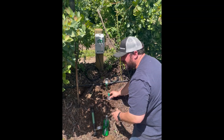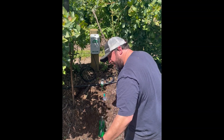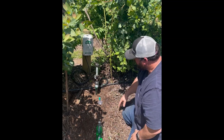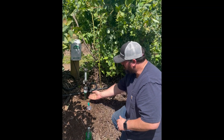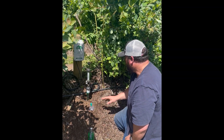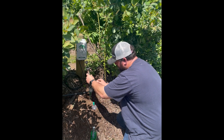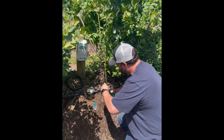The last thing I want to do is take the cap back off and make sure I get all the air bubbles out of the instrument. If you have any air bubbles you can get bad readings, so we don't want that. I take the pump, put it on here, and get a couple good pumps. It creates a vacuum and will start to pull any air bubbles out of the instrument and to the top. I check and see there aren't too many bubbles coming through, then lightly release on the nipple and take it off.